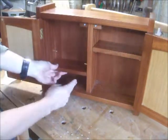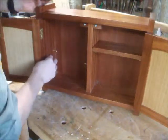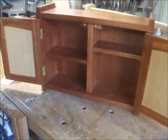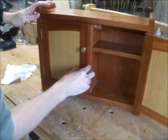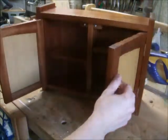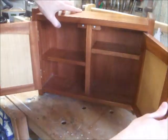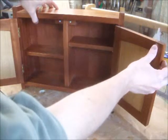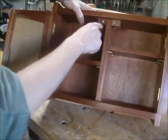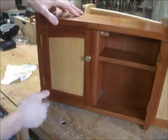In hindsight, it would have been better to have maybe three different heights around the middle, so you still get some variation. I'm reasonably pleased with this considering all that went wrong. The back panel is veneered MDF. I've also fitted some magnetic stops — they're dead simple to make. A couple of magnets in the back of the door, and on the underside of the top you have two wooden blocks with screws, so you can adjust for movement fore and aft, so that the door rests in the correct position, whether you want it flush with the outside of the frame or stepped back in slightly.